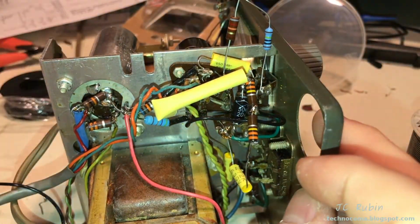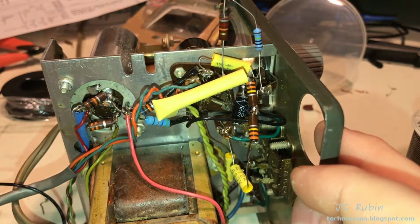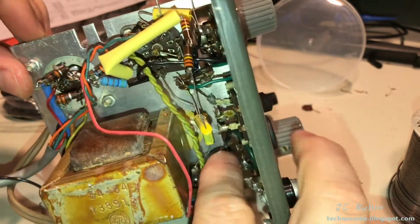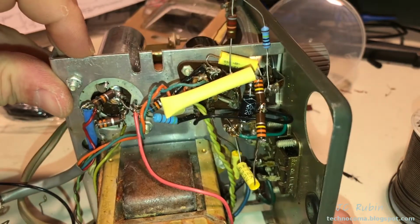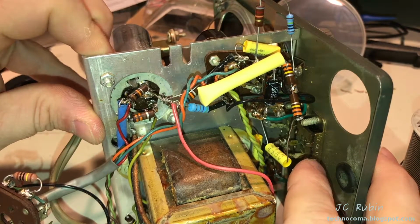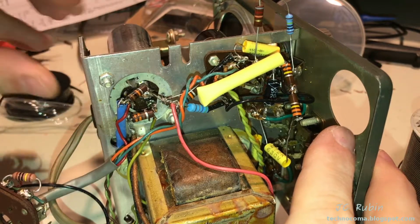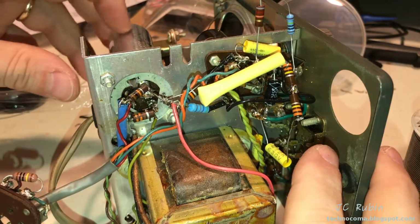And with this, the entire 12AX7 circuit has been rebuilt using the existing coupling capacitor that's in place. I'm not really concerned about that just yet. And you can see that second yellow capacitor down there, ultimately to be changed, but it's not going to be changed at this moment. Also, the reason why I've left all these leads long is that this is not their permanent fixture. I don't feel like chopping these up and ruining them, so I'll just leave it long and ugly right now and redress them later. But everything should be in place for final inspection so that it could be turned up.